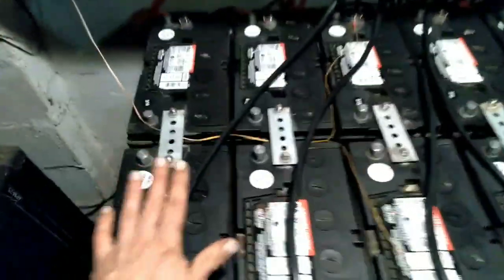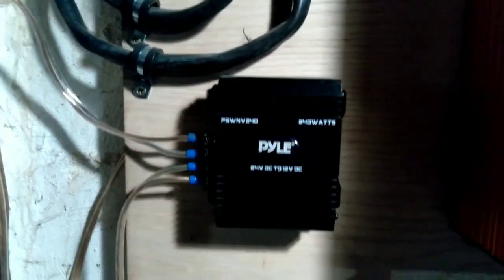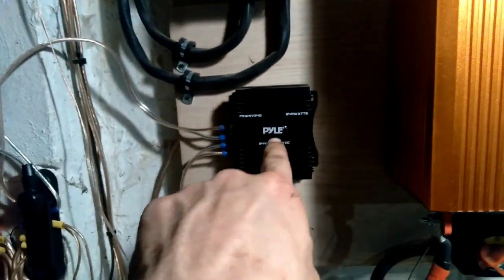Right here, we got a step-down converter, 24 volt to 12 volt. I've got a 24 volt bank, 10 batteries. It's actually 5 batteries because each series essentially is 1 battery. So I've got 5 24 volt batteries. Accumulates 550 amp hours. And to run my 12 volt DC loads through the house, I've got various fans, phone chargers, even a ceiling fan, a couple odd things upstairs, and some workshop lights. That's all distributed right here, and this produces the 12 volt.